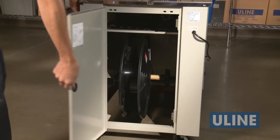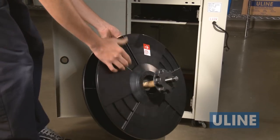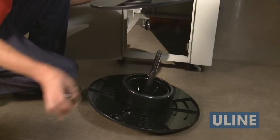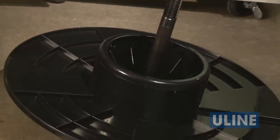Open the left side door and remove the plastic reel. The Uline Strapping Machine is compatible with both 8x8 and 9x8 machine polystrapping. The reel comes preset for a 9-inch core. Remove the plastic adapter for use with 8-inch cores.